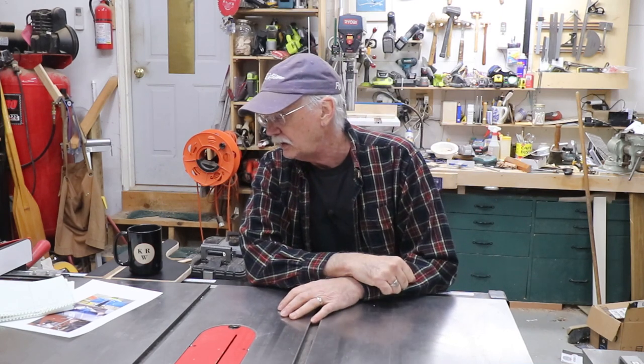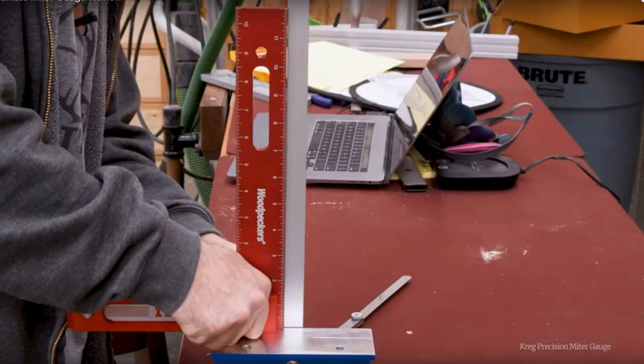Basically, full disclosure, here's what he found. What shocked me was the Craig miter gauge. He found that the miter bar and the miter gauge itself were out of square by a few thou — maybe more than a few thou. If you look at this picture, you can see him testing the miter gauge face to the miter bar, and it's touching the bar at the bottom but there's a gap at the top. So it's out of square to itself. This was not only the one he bought, but the same amount of lack of precision was found in the one that Craig sent to replace it.